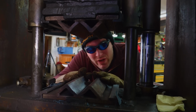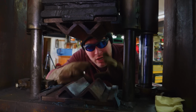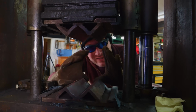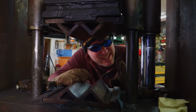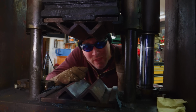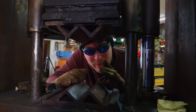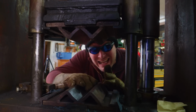So these are my squaring dies. I'm gonna put the billet edge up in here, and it's going to start to distort the layers. It's gonna make those layers curve into what will become W's. I want these kind of passive-aggressive W's that kind of match the W's that I made for the fittings. That's what I'm going for here. So we're gonna add in a little bit of that distortion with these dies next.